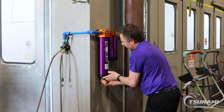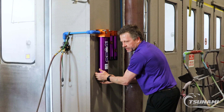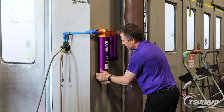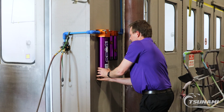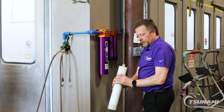When we pop this cover off, you just slowly want to pull the cover down to make sure that the desiccant cartridge is still secured with the quad ring up in the head. As you can see, now I can grab onto this desiccant cartridge, just give it a little wiggle, and it'll drop out.